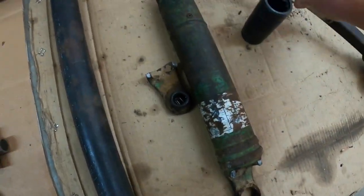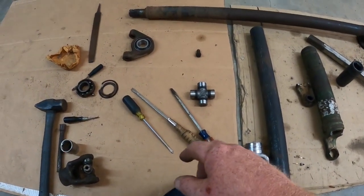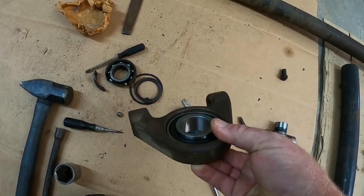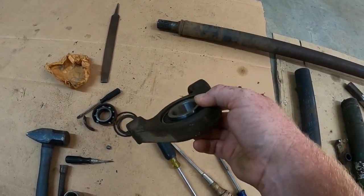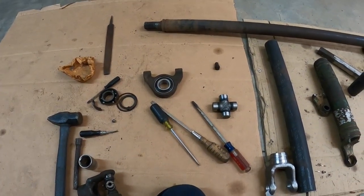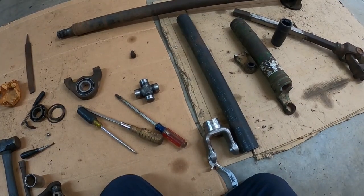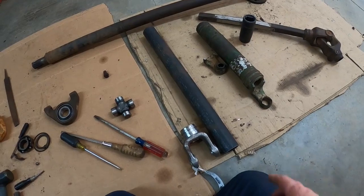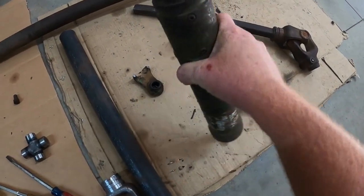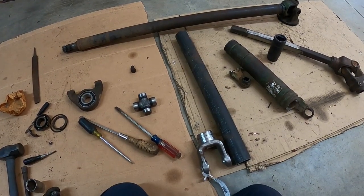So it's good and tight — inch and three sixteenths. What we have to do is cut this pipe down to that length close to it, put the new U-joint in. And while I had it apart, here's the original roller bearing in several pieces that was in this block here. This is the support for where that PTO shaft comes up and rides in this, and then the front one attaches. I actually bought that bearing from John Deere when I bought the bush hog and did the clutching stuff. So that's where we are so far. I'll bring you back and show you a little bit when we get these pieces — might get some footage of pressing them in. It's just a snug fit, not like it's got to be pressed in, but with the collars and stuff on them, hopefully everything will be good. You can see how worn out that is with those roller bearings.